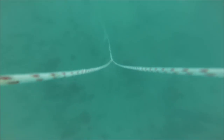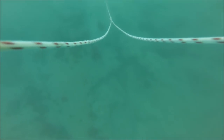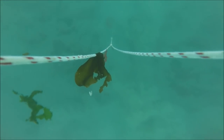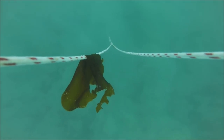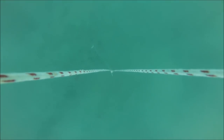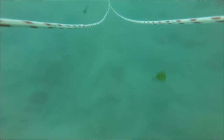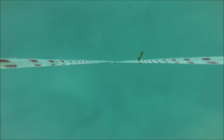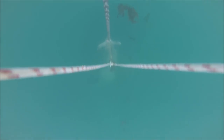Here's the 33-pound Bruce at 2.5 to 1 scope — I didn't test the 44-pound Bruce, but those anchors behave quite similarly. The anchor struggles at this really short scope but does eventually set. Keep in mind these short scopes are not recommended; I'm doing them for test purposes only. The anchor has a list, but did eventually reset and hold. At this point I haven't had any trouble with the Bruce anchors — they're doing just fine. On retrieval it's got a little bit of seabed attached, but not much.